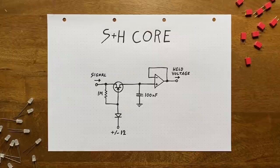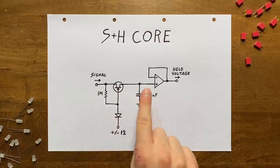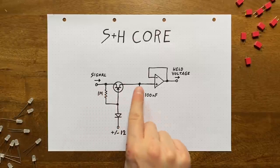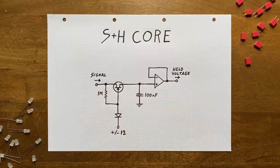This is where the JFET speed limit takes its toll. As we push up the frequency, we're charging and discharging our capacitor faster and faster. But because the maximum amount of current that can flow through the JFET is capped, we're neither able to completely fill nor drain it. And this only gets worse as the oscillation's frequency increases. But it's a flaw that I think we can live with. What we really can't live with is the fact that currently we're still operating the circuit manually.